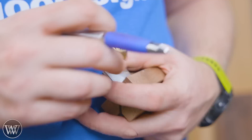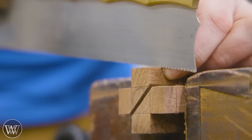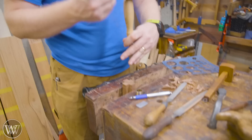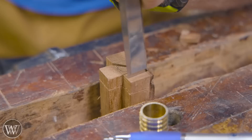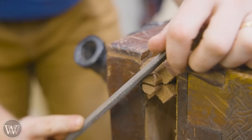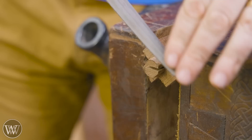The next thing is cutting down the sides for the collar to fit onto. I can lay in that collar and find out how far I need to cut down either side — I want the collar sticking up by a little less than a quarter inch, something around three-sixteenths inch, so there's enough space for the screw head to fit into it. Once we've marked that out, I can come in with the saw and cut down to that circle. The fun part is coming in with a chisel and breaking off these pieces — busting off big pieces with a chisel is always very enjoyable. This will get us close to square, close to round, but not quite, so we're going to come in with a saw and cut it octagonal. The saw cuts in until it gets close to that rounded edge, then we can pop those out with a chisel.